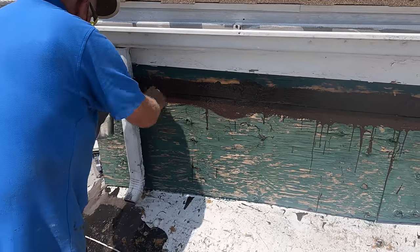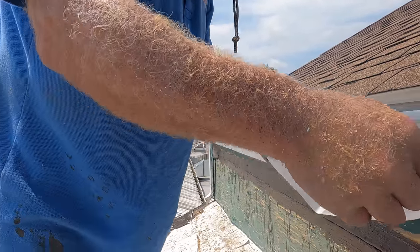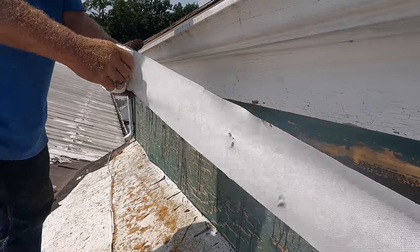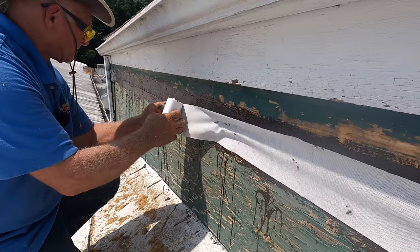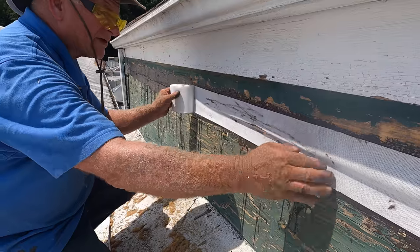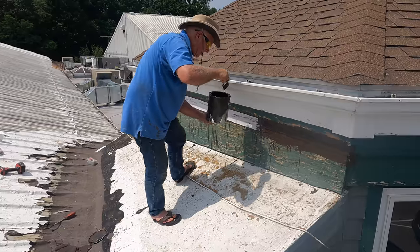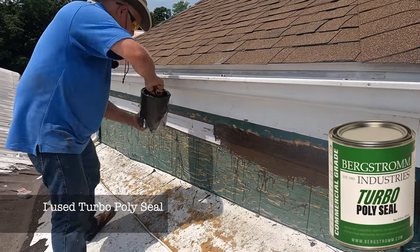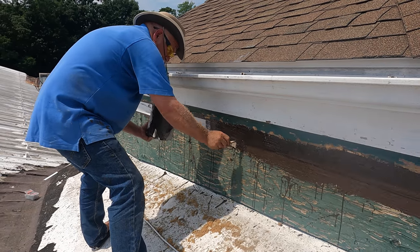You get the idea — you've got to get a lot on there. I put the fleece down, just like that. Look at that — it covers that area where the water can just rain in. A beautiful transition, wood on wood, but they didn't have good flashing.